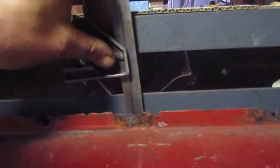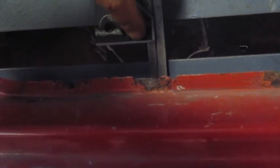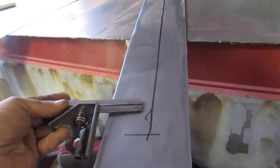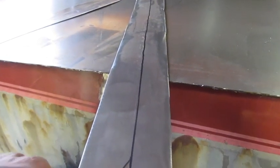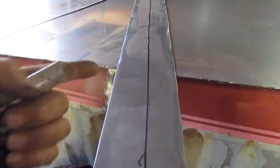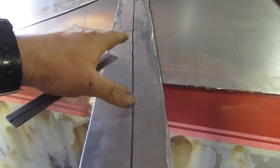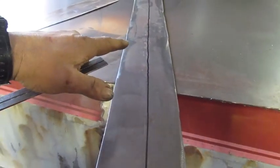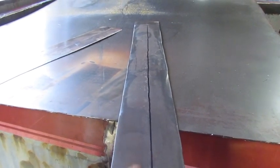I've taken a square and put it in here to find where I'd like my bead. The bead can't be laying against anything, so I think it'll be okay there. I ran my line just to follow it and it should let me lay this panel back. You can do a bunch of fancy designs with the bead roller, but really the bead roller is just to stiffen the panel so there's no bubbles after you weld it — it's gonna shrink and all that. If you place the beads in a way that the panel can't bow, that's all you're really trying to do.